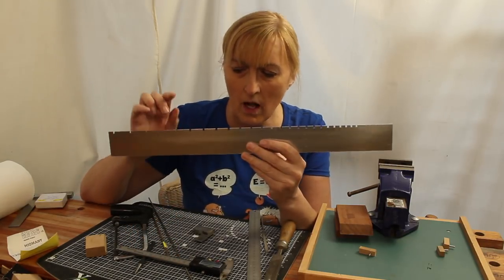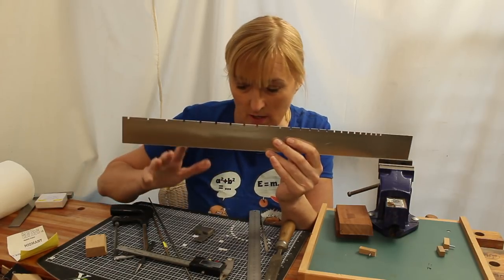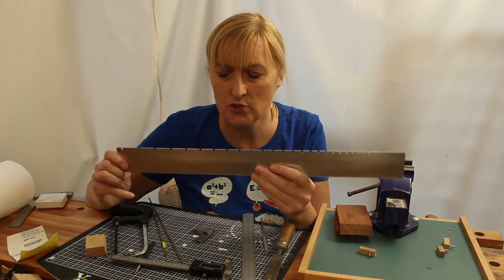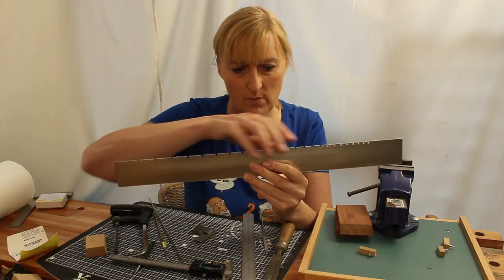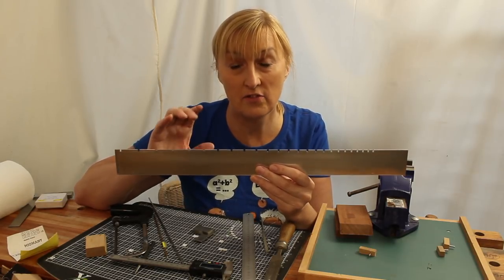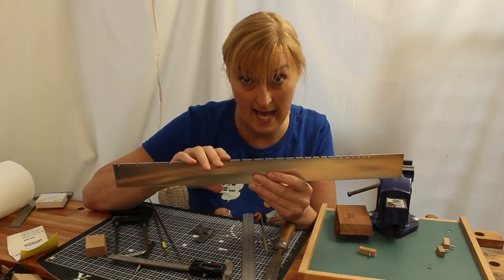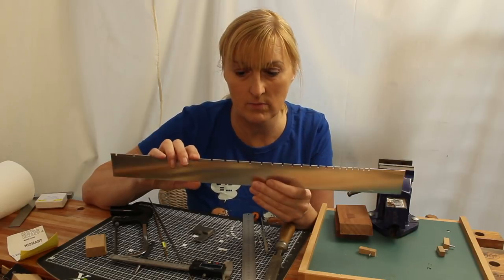Another thing I noticed, I scratched the initial nominal measurements of the slots using a ruler, and I checked before my three devices, my accurate ruler, my big ruler, which I wondered whether it was accurate, but it agrees with this very closely. And they both agree with my calipers. I measured using the ruler initially, the scratches, and although they seem to be fairly accurate down here and up here, some of the marks around the middle part of the, let's call it the neck, were as much as half, maybe more than half a millimetre out. And I think this is because of parallax errors. I'll review the video, but I suspect I was looking at the ruler from the side and I wasn't getting an accurate measure. So if you're going to be measuring your frets by hand on the fretboard, beware of that. Make sure you're lined up with the ruler, because you really need to get them as accurate as you can.